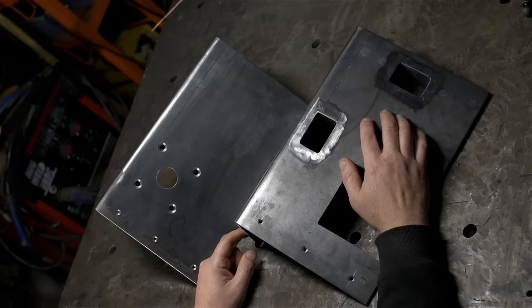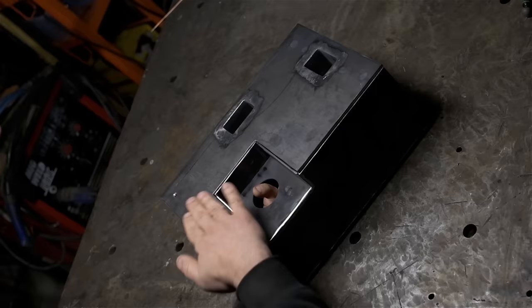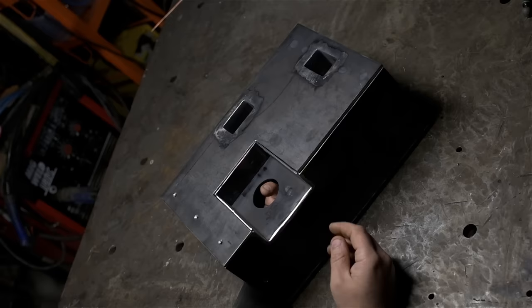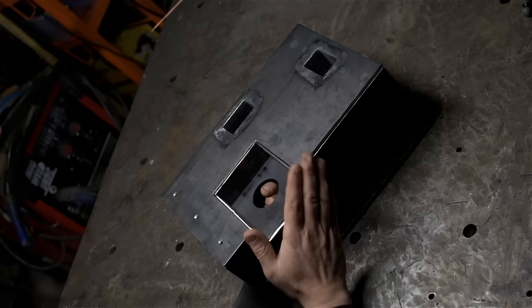There's a little step cut out in here that creates a recess for the ground clamp once the through shaft of the chuck comes through and keeps it below the surface so I can still flip the positioner around any way I like. I don't know if this is the smartest way to do it, but I'm going to run with it. Not attaching to that shaft would have meant some kind of brushes or braided cable, spring-loaded stuff, and because I'm using the gearbox, I don't really have any access to that shaft other than here, though I guess I could have closed it, done that on the inside, and just had a provision to ground to the casework itself.